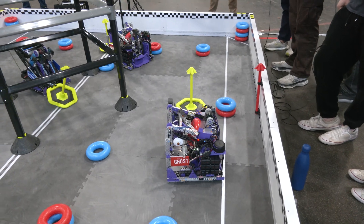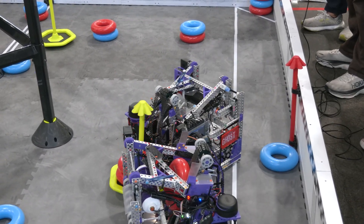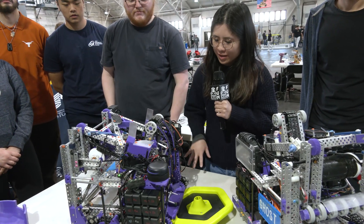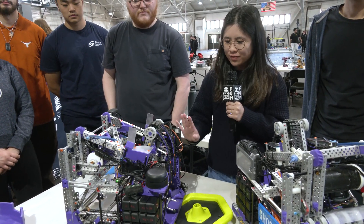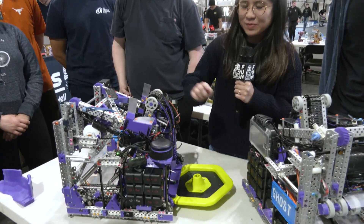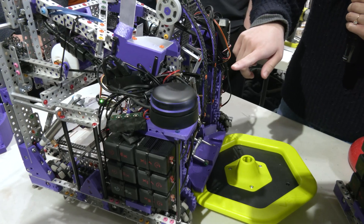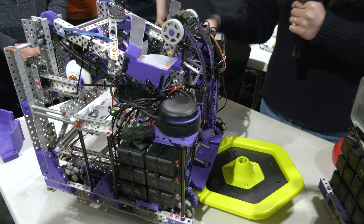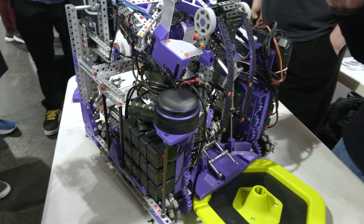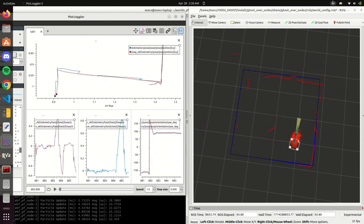Melissa, we really got to dive into this LiDAR. It's obviously a big star of these robots. Just talking about how your team is actually benefiting from it. So most VEX robots use wheel encoders and maybe an IMU to localize their robot, which can be good. But especially during an auton, if your robot runs into something, your odometry is immediately confused — your robot doesn't know where it is. That's a big challenge we wanted to address. The spinning thing is a LiDAR, and it's similar to how sonar operates, but instead of sound waves it uses light. We use that data in addition to wheel encoder data and IMU data. It all gets fed into our second processor, a Jetson Orin, which is somewhere deep inside. That all gets fused using an extended Kalman filter in addition to utilizing the LiDAR data via a particle filter. This all comes together to make a really robust localization stack.